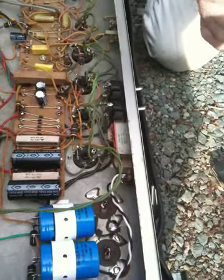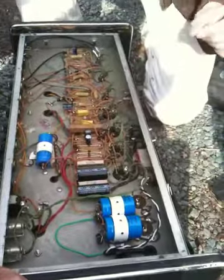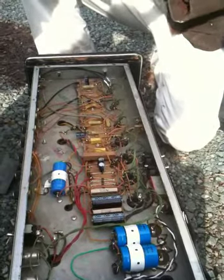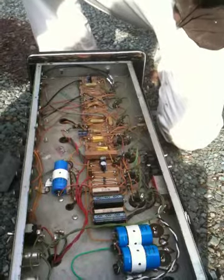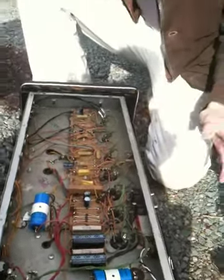But your other caps, you could squeeze them and you hear a crackle sound, which means that they're starting to form voids of air. All the juice was set on the bottom, and they were probably getting ready to go. So hopefully it won't blow.